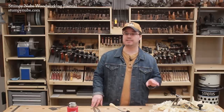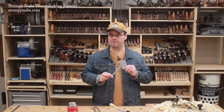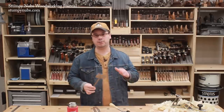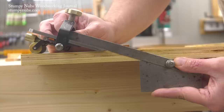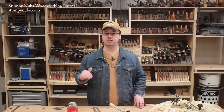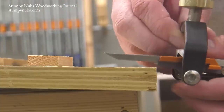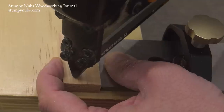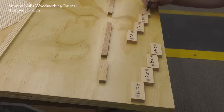The location of the stops depends on your jig, but it's pretty easy to figure them out if you have one of these protractors. If you don't have one, I'll link to an inexpensive source below this video — they're very useful for all sorts of things. To find your angle, place the head of the protractor on the underside of your platform and across the back of your plane iron while it's mounted in the jig. This will tell you the angle your iron is set at. Adjust the distance the iron protrudes from the jig until your protractor reads at the angle you're looking for. Then place the body of the jig against the edge of the platform and attach a stop against the edge of the iron. If you want more stops for other angles, just repeat the process. I'll link to another video about bevel angles below.